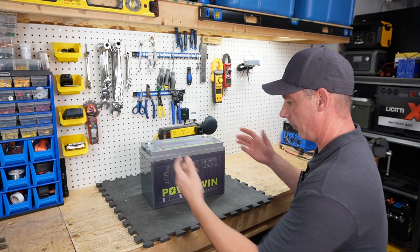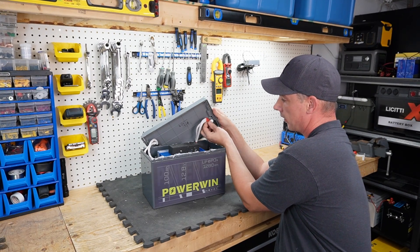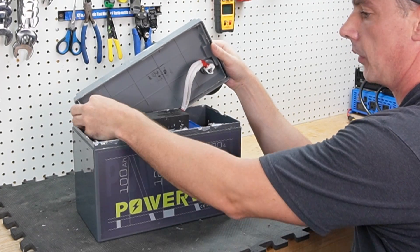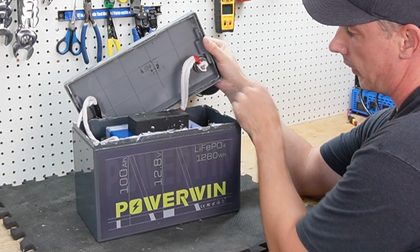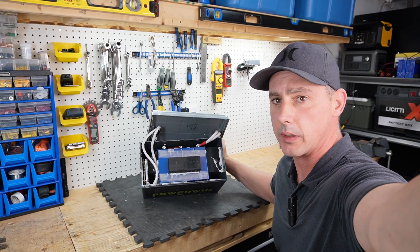With the power of film, I've got it open. Right away we can see we have hydraulically crimped lugs with fire protective sleeve and a couple of conductors for the positive and negative. They are glued onto the terminal posts for extra security. And we can see the cells in here — let's zoom this in.